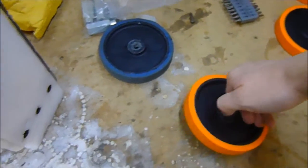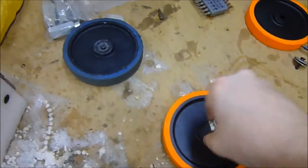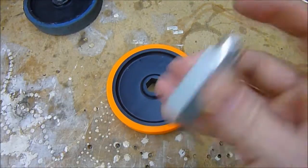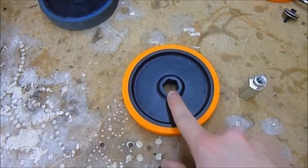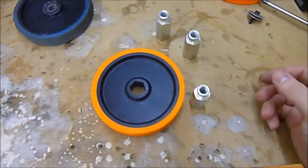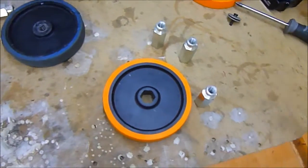And there goes the wheel. So yeah, that's just a quick video. These hubs are just 3/8 inch UNF thread on the inside for the drill motor, 3/4 inch hex on the outside, and the Banebots wheels have got a 3/4 inch hex cutout. Obviously you can get these wheels in smaller diameters. You can get them off eBay, Technobots, Banebots. It's quite a nice easy way to get Banebots wheels to fit on your drill motors without having to faff about with a nut insert method. Hope that's helped — see you later.